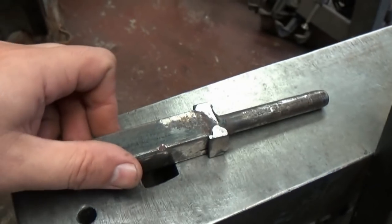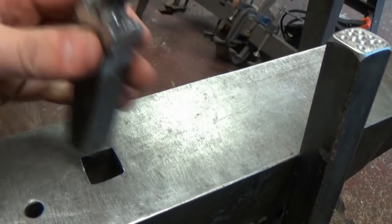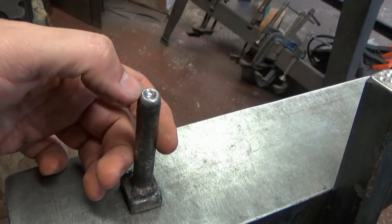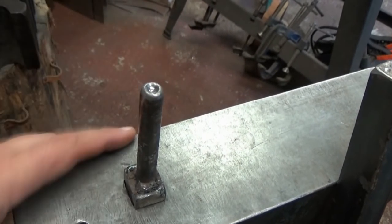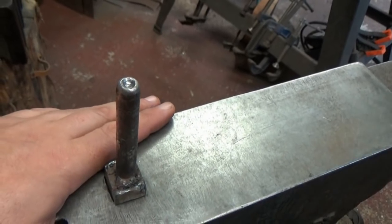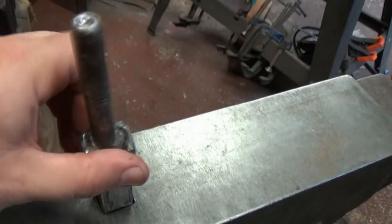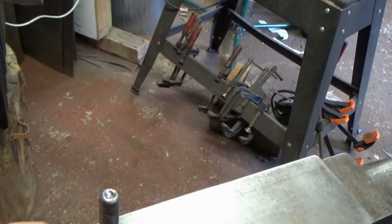This is a snap tool I made about three years ago. It's a bit of 10 or 12mm bar stock, mild steel, welded to this piece so it fits in the vice nicely, and I just stuck these lugs on the side. All I did was put a 5mm drill bit in the top and chamfer the edges around. Now when I offer up pieces on there, I don't deform my rivet heads at all. It's on this nice length here because it takes the work away from the face of the anvil, which means if I'm offering up strange shapes I'm normally not touching it. And for the odd time I am, I just stick it in a vise and lift it well clear. Very straightforward tool to make even if you can't weld — just find a bit of bar and stick that in the vise.